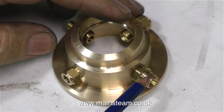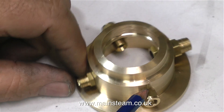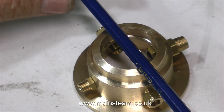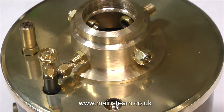I drilled another two holes in the fitting: one of them is for the exhaust inlet, and the small one is for the blower inlet. Of course you've already seen the wet steam inlet and the dry steam outlet. The steam inlet and outlet is really a straight through connection, and all that is in between these two connections is a coil of tubing inside the housing. As this coil is going to be immediately above the fire tubes, it will get hot and dry the steam. When I put the fitting in place you can get the idea. Originally I had the safety valve positioned in the centre hole, but now, as I'm busking this, I'm going to put the blower valve in the centre hole, because it's the obvious place for it and it's going to be very easy to line it up with the fitting.